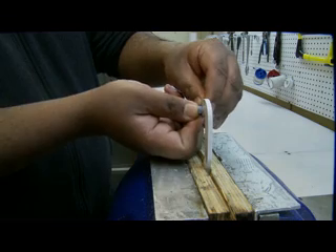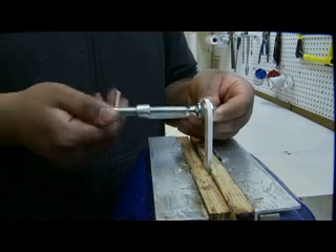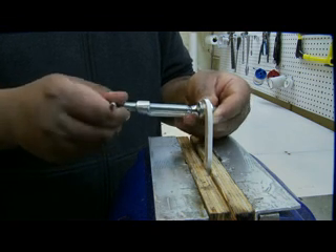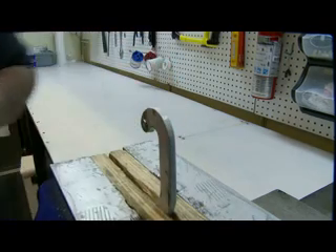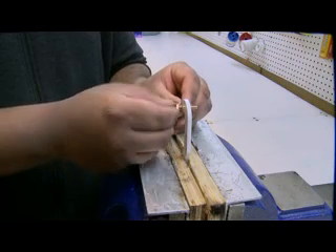Press the bushing into the bore using a C-clamp so the bushing is squarely aligned with the bore. The bush length is the same as the thickness of the hinge arm. Test the fit of the stainless steel sleeve in the bushing bore — it should be a sliding fit, and it should also be slightly longer than the bushing.